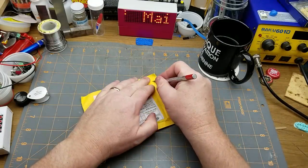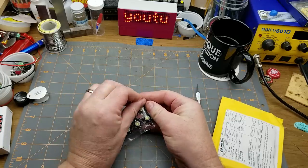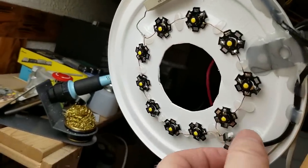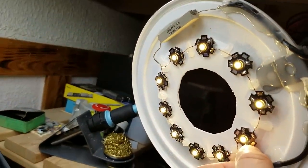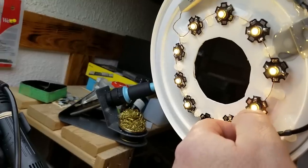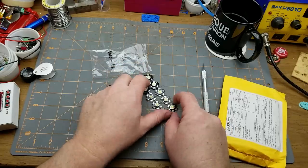Next item is called 'LED diodes' — as opposed to non-diode LEDs, I don't know. It's a bunch of what I think are 1-watt LEDs. I've got some of these already on a cheesy little ring light I built a while ago. I haven't used it much because it didn't really work well and kind of muffled the audio and got in the way, but it does sort of work. I'm using a constant-voltage power supply with a big beefy resistor in series to limit the current. Those ones look natural white or maybe warm white — not quite sure what these new ones are, but we can put them to the test.